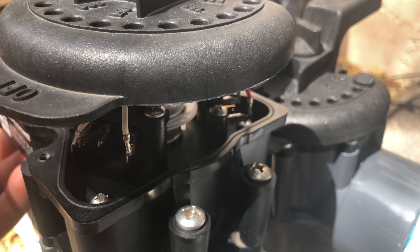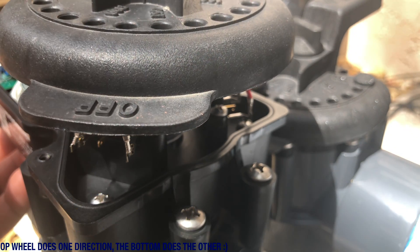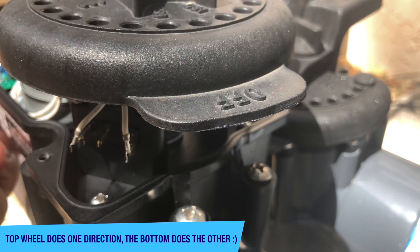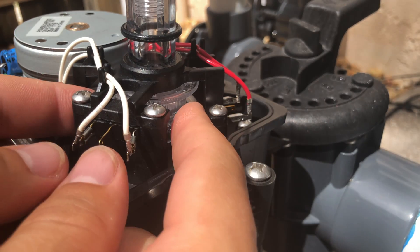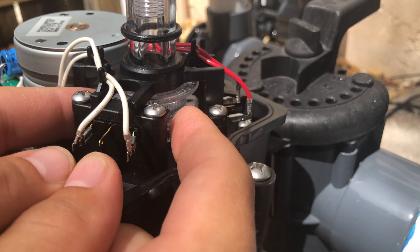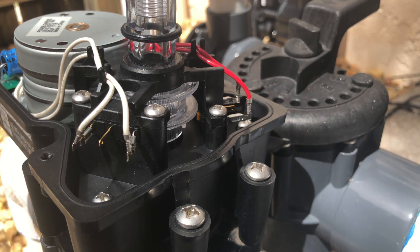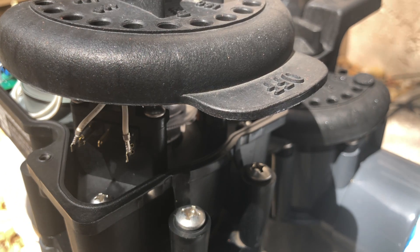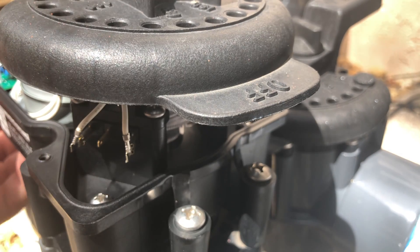Just for demonstration purposes, we're basically going to move the timing wheels until we get to the spot we want. We're going to stop it right at 90 degrees and then move this wheel around until the switch gets activated — there we go, now it's depressed. This should stop right at 90 degrees — just like that. That's basically how you time the actuator.